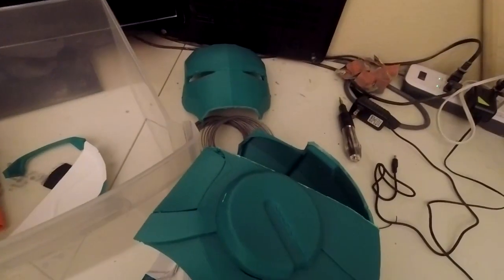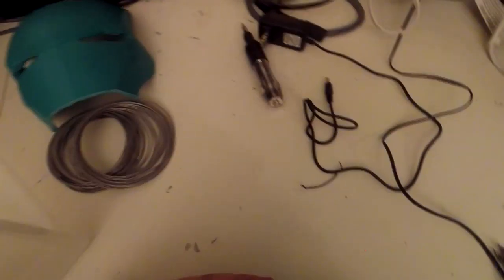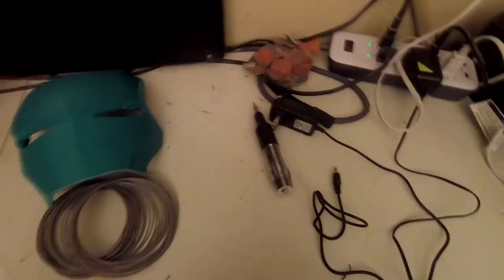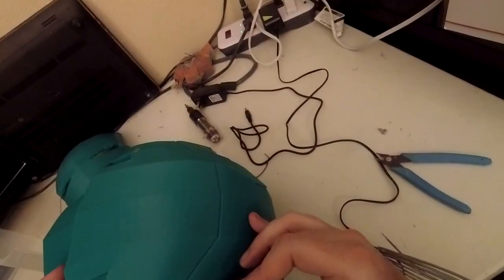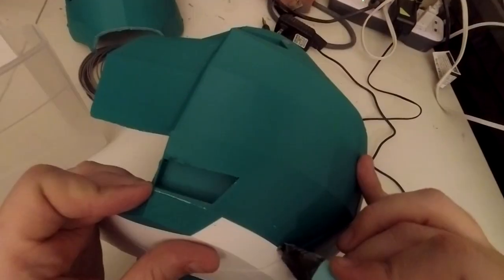Now I'm attaching the lower left side piece - two spot welds on the outside, then go back inside and do two more spot welds on the inside. There's a clear pattern here: every single seam you do, you want to make sure you do two spot welds minimum just to make sure the unit will actually stay together.